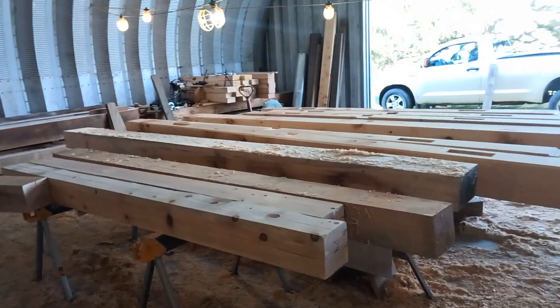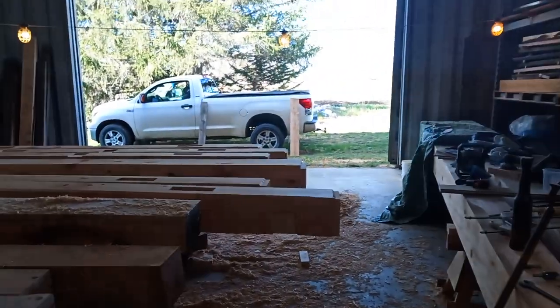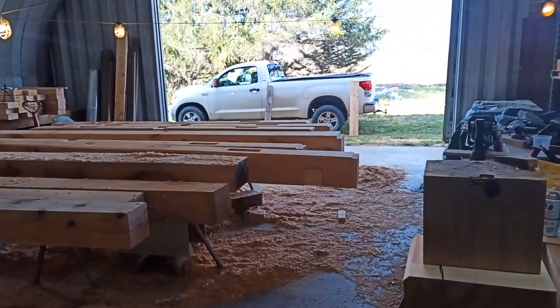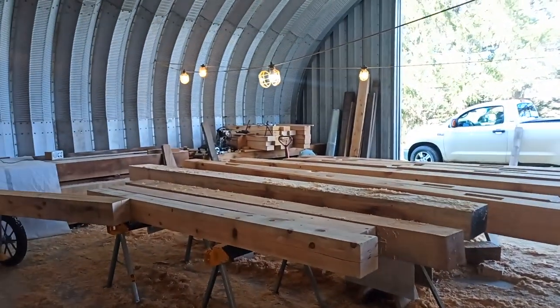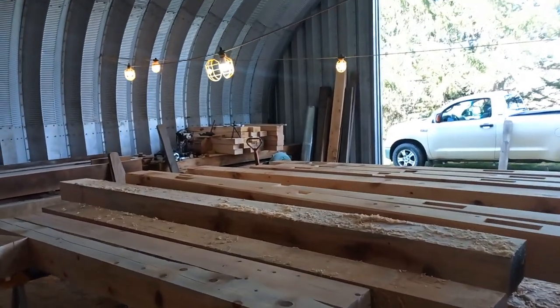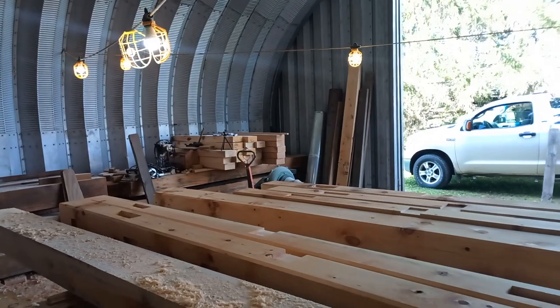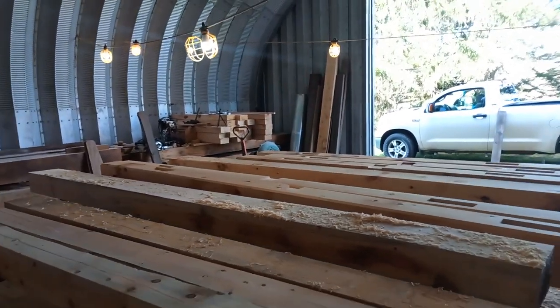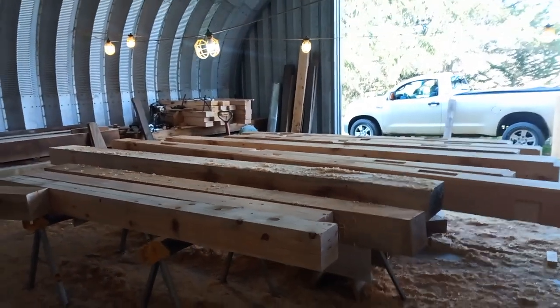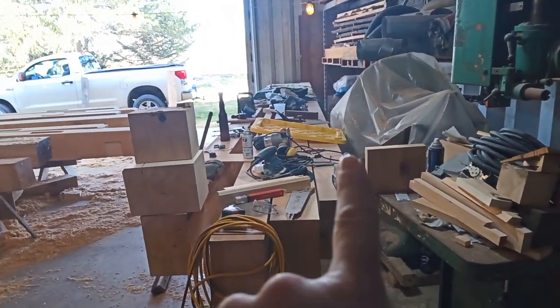In the last video I had the tie beams out in the center. They have all been laid out, checked and double-checked, and I've set them aside. I had a couple friends up here that helped me process the brace blanks — that's about two-thirds of the brace blanks over there. They're all squared off now. I just need to bring them down to final thickness and cut the tenons on each end. They also moved the completed — not cut, but laid out — tie beams over to the side.